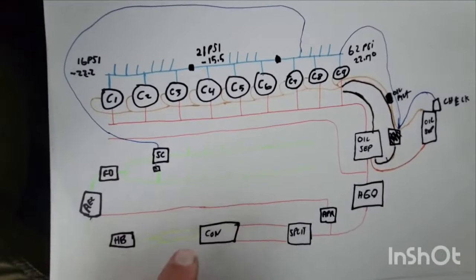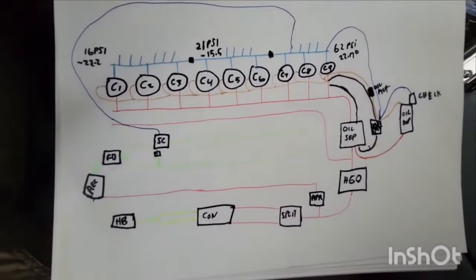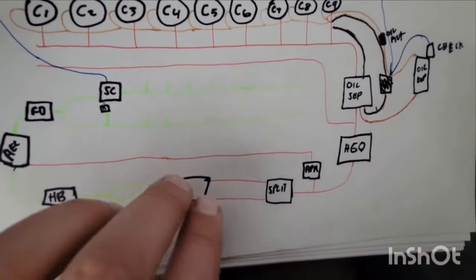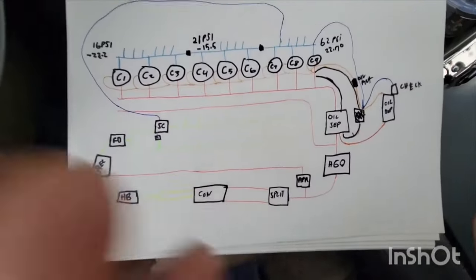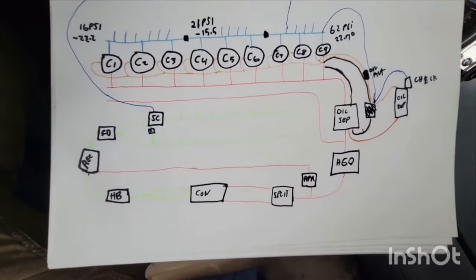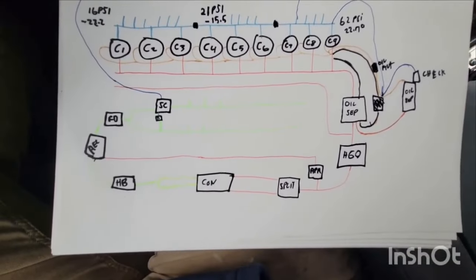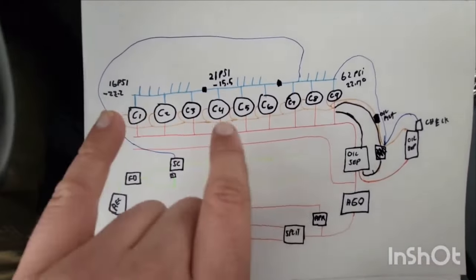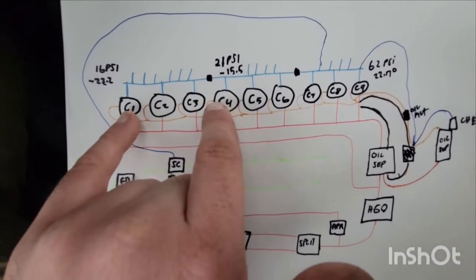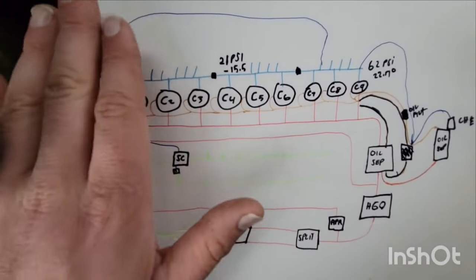Now this last one is the subcooler. So why does a subcooler matter? Well, say you're on an 80 or 90 degree day and your condensing pressure is okay, like 200, 220. It's where it needs to be, nothing crazy like 325. And specifically your low temp suction group is not satisfying and all three compressors are running, then you might want to look into the subcooler.